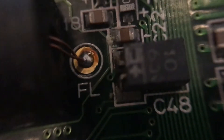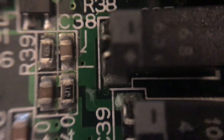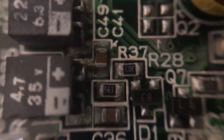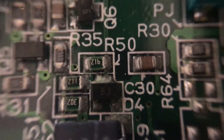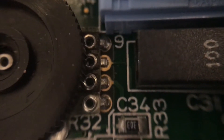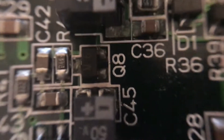What I'm going to be doing here is, first of all, replacing all these capacitors. Some of the other ones look quite bad. But other than doing a recap, I'm going to be reflowing a lot of these dry joints as well. This one looks pretty okay. I'm not sure what caused this — maybe it's just been in storage for a really long while and not used much.